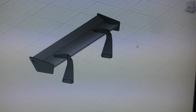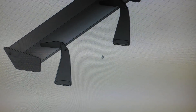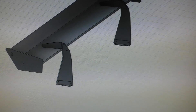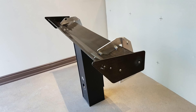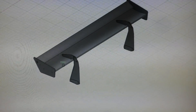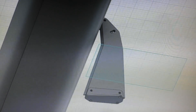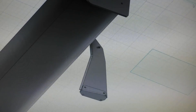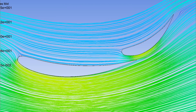Starting off with the design for the rear wing — this first one we're actually making for a Lancer Evo. The person wanted the wing to be bolted on the same places that the factory wing is bolted, which is why these supports are so far apart. They're also top-mounted supports to help the aerodynamics so that nothing disturbs the airflow underneath the wing and it can stay attached all the way underneath. The same reason why we added knife edging at the back of the supports, and made them such a smooth shape so the airflow doesn't get disturbed. This is how the profile of the wings looks, something I worked really hard on getting the shape right so that the wings actually perform better aerodynamically.